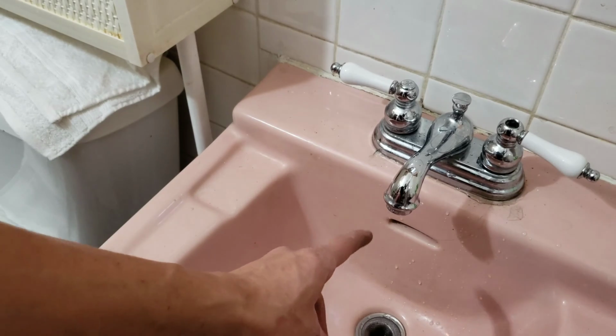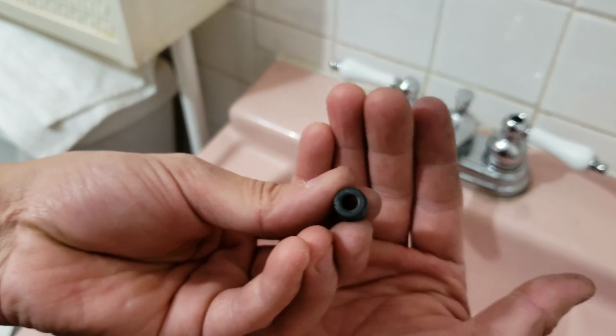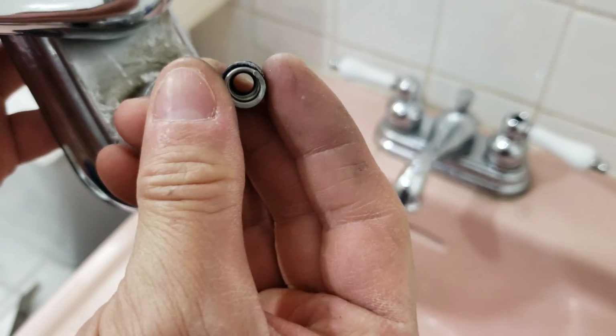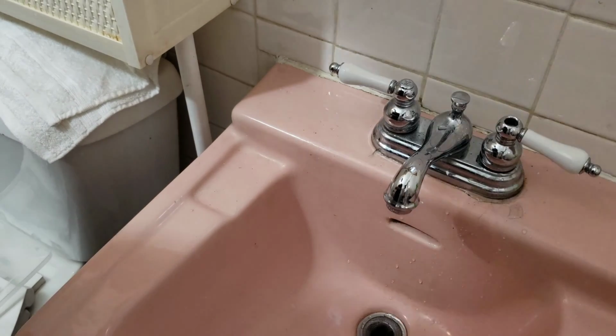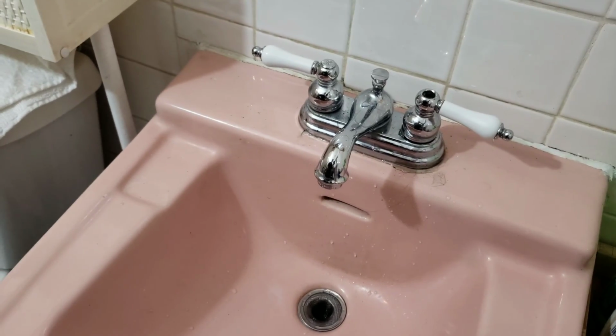Alright, so if your water drips or runs non-stop after you shut it off, it's these little things sometimes. The seats. Right there, inside. Right there, that's the spot. That's where these seats sit. Either rubber or plastic with a spring goes into that hole that seals the water when you shut it off. Okay, still holding. That's good. Thank you guys for wasting your time with me.